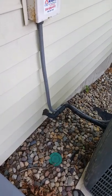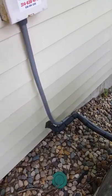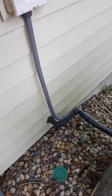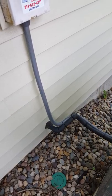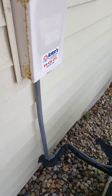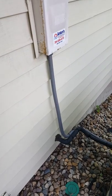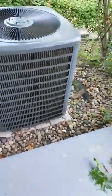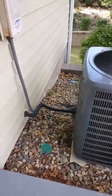The customer is super sensitive to noise, so make sure whatever part goes through the wall is foam-taped around it so nothing is sitting up against the wood. Same thing when strapping it up inside the wall — use PVC plastic plumber strap to secure it, don't use anything metal.